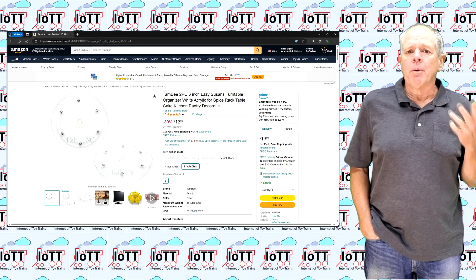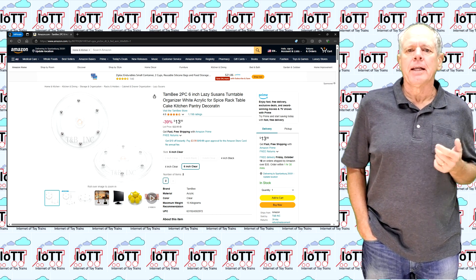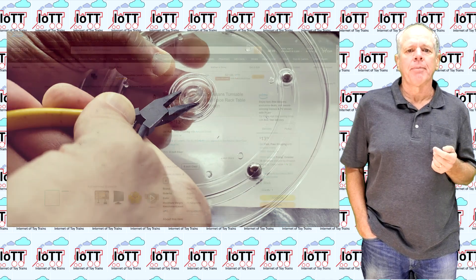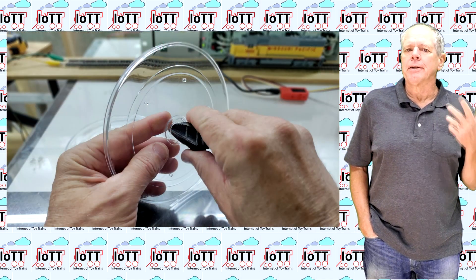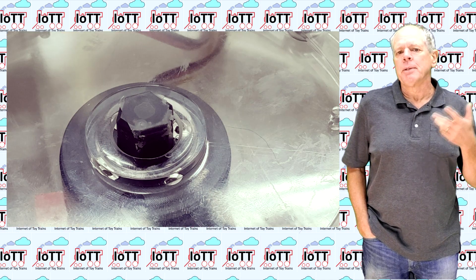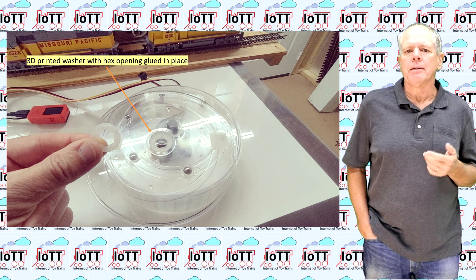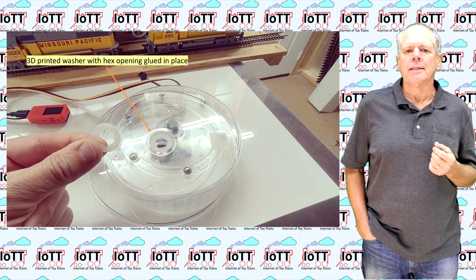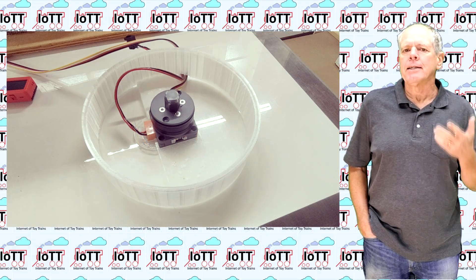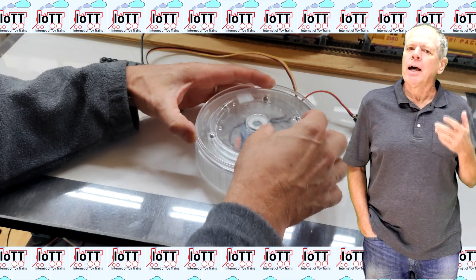For the rotary element, I bought a pair of 6-inch Lazy Susans from Amazon. These devices make for excellent turning elements as they have built-in roller bearings and therefore have a relatively low turning resistance. I removed the center piece and increased the diameter of the center hole in the bottom disc just a little bit so that the hex shaft of the BLDC motor would pass without touching. Then I 3D printed a washer with a hex opening for the drive shaft and glued it to the top disc of the Lazy Susan. Finally, I 3D printed a frame to hold the motor in place and to provide the right distance so the bottom disc of the Lazy Susan does not touch the rotor of the BLDC motor.